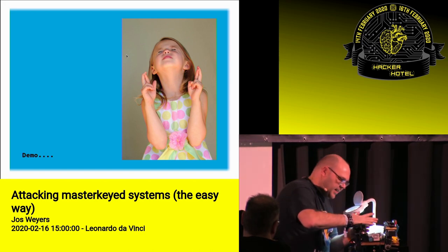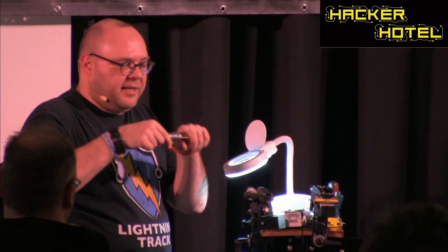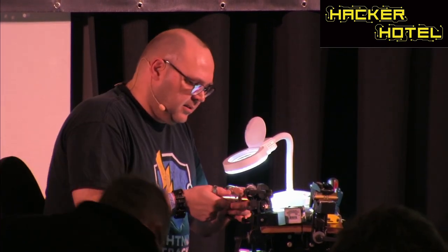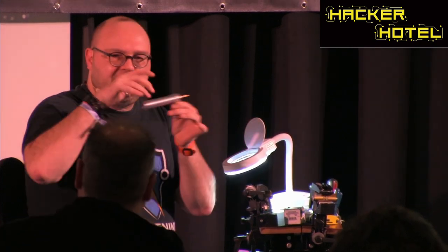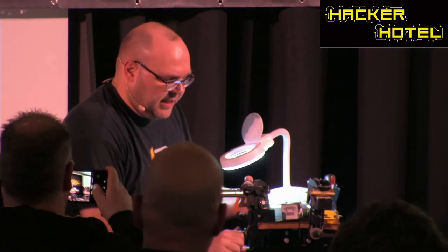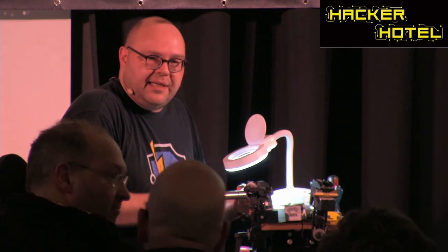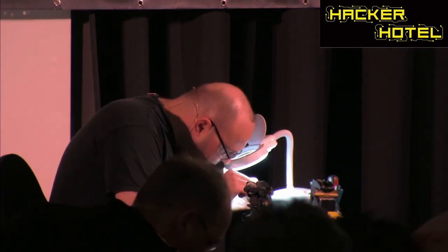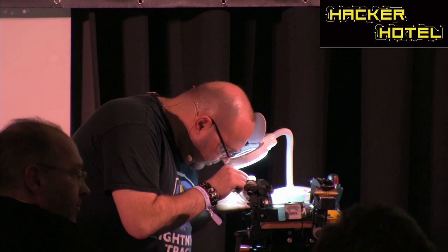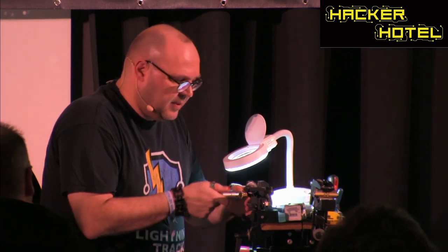all sorts of stuff. This is a lock. Actually, it's two locks, but let's start at number one. We have a key that I've prepared. The surface is a bit smoother now, so I should be able to see marks. Key in. I use a handle to have a bit more force on it, but basically still a key. Turning force in one direction, move it up and down, make it a bit less jiggly. So I move it one direction, other direction while I'm jiggling. And then I look at the key. Marks can be quite subtle. And I take off some material. Like you saw, that's some.